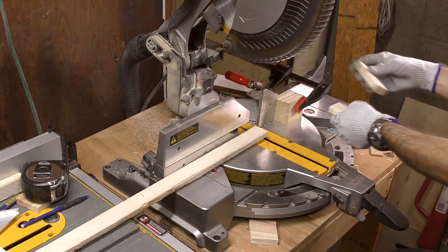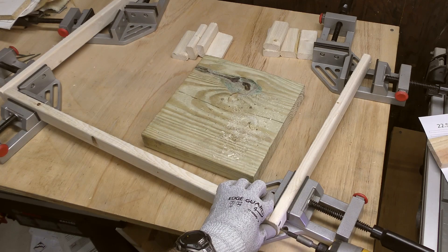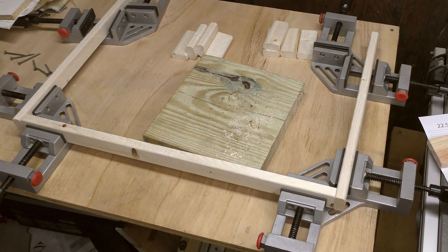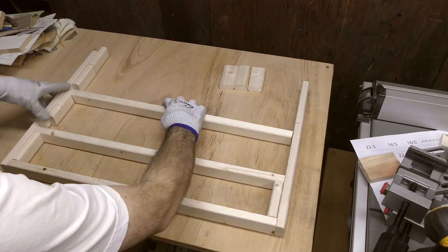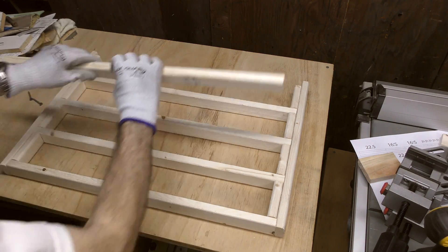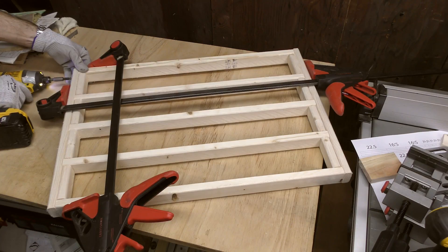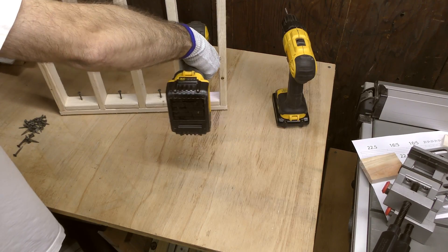You'll only need two eight-foot boards. Here are all of the board cuts. For assembly, I used corner clamps to fasten three of the outer boards, then inserted spacer blocks, a support rail, and so on until the last board is in place. The spacer blocks create a perfect gap, and by clamping the boards it's easy to secure it all with drywall screws.